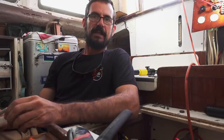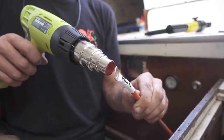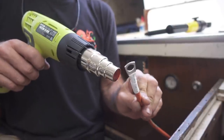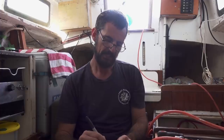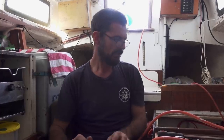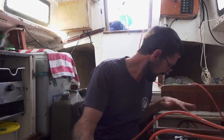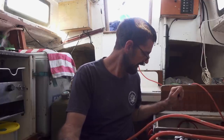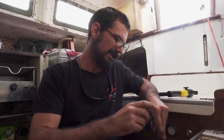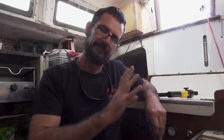If you're looking for a good labelling option: white shrink wrap and a marker pen. Write 'alternator, full size' — labelling things clearly helps everybody. You might do a job and not touch this for another two years; this will help jog your memory. When you're looking at all these cables you might think, 'well of course that's an anchor cable,' but I'm labelling it back here in the compartment — when you're looking down there's just going to be a big jumble of cables and you want to be able to see what you're looking at fairly easily.